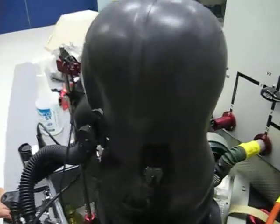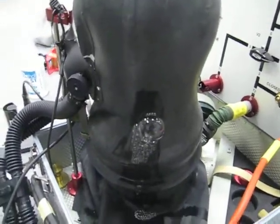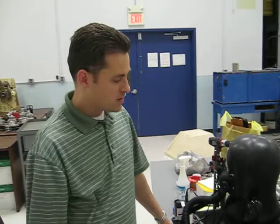I'm just going to pour the snoop over the area and sure enough, look at that bubble solution go. Same spot on the JSMLT — via the probe, found with the positive pressure and the snoop bubbler. Thank you, Tim.